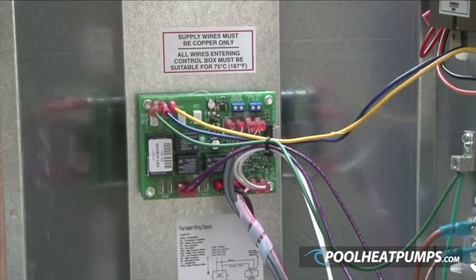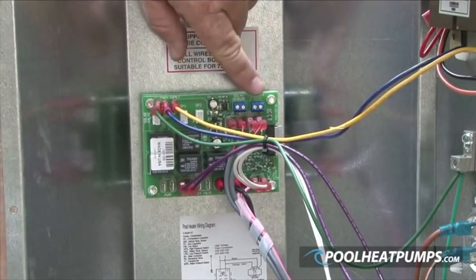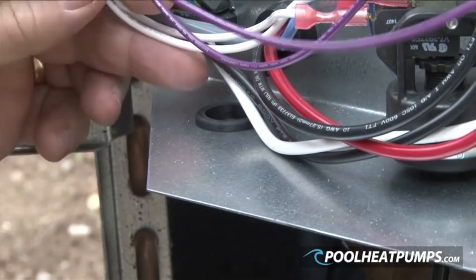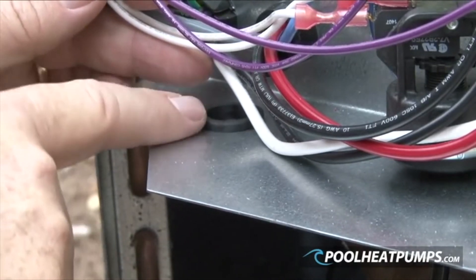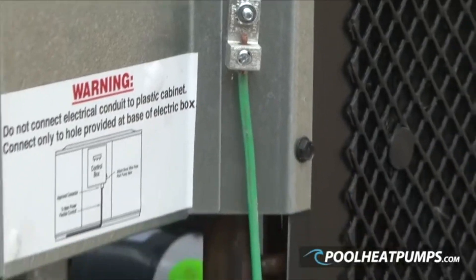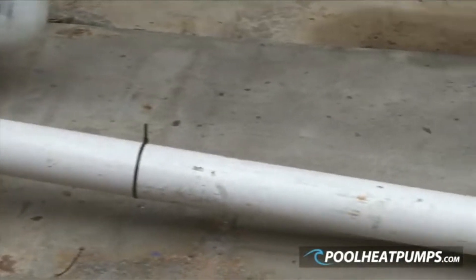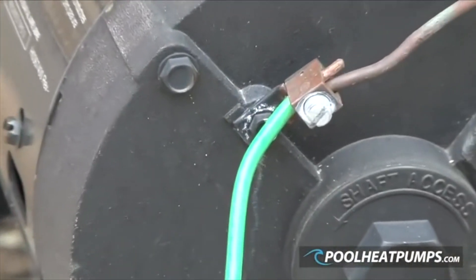On the top right hand corner of the control board are the connections for outside controllers. Only dry contact, no voltage connections are to be made here. In the bottom of the control box there is a rubber piercing plug through which to run the low voltage wiring. Bonding is often confused with electrical grounding. On the outside of our control box, on the bottom right hand corner, is a bonding lug. Because all metals have different electrical potentials, all metal and electrical components of the pool system must be bonded together.